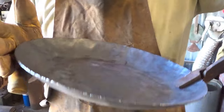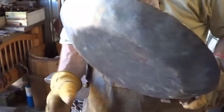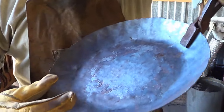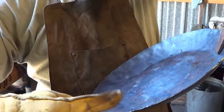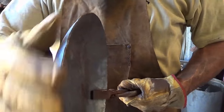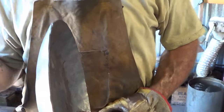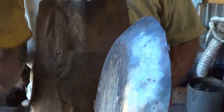I'm thinking I like the way it looks. If you want a curved-sided pan, I think you're ready to go — just clean it up a little bit. I would really like to try to straighten it though. The two techniques I saw: before you put any shape into it, you wrinkle this and then upset it together — basically pinching like you would a pie crust around the outside — and that should upset the steel. In the second technique, the guy made a bowl, then flattened the bottom like we did today, then went back and worked the rim on the anvil. I'm going to copy him since I'm learning.